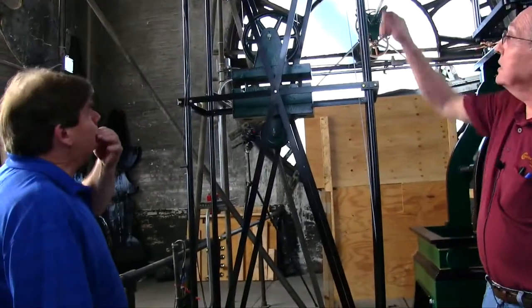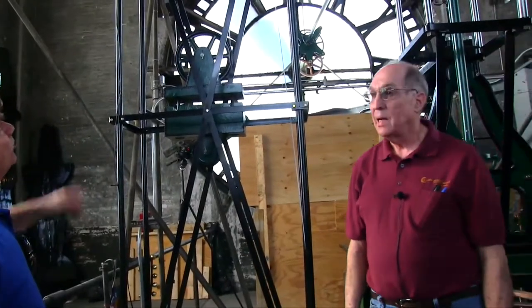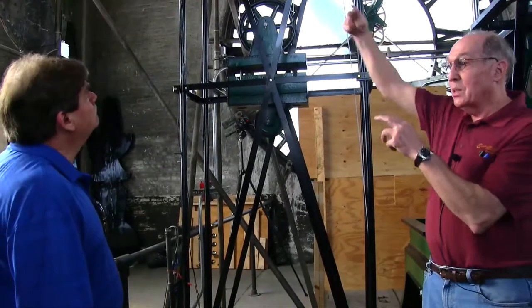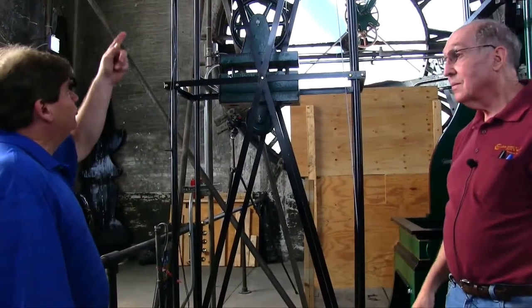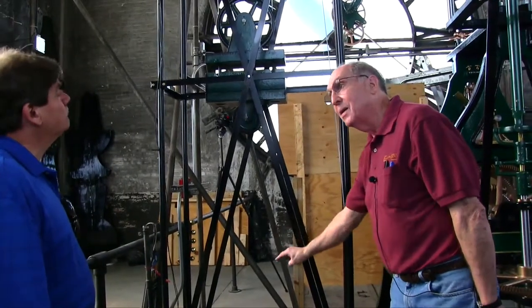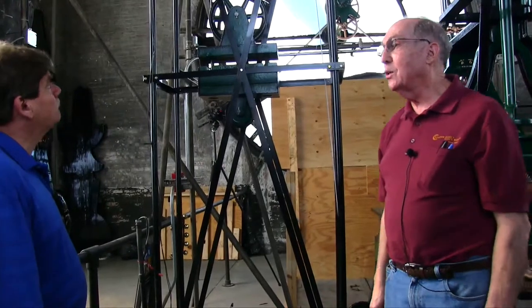The key part is the red piece. So you can keep the clock from damaging itself. The wire will come out of the top of the red piece — what comes out is a key. It pulls the key out and you'll see the key dangling there if it fails. Nothing can happen until you re-insert that key, except the clock will continue to run because the weight will come back down. But once it gets down here and hits that switch, it's going to do nothing until you fix it.